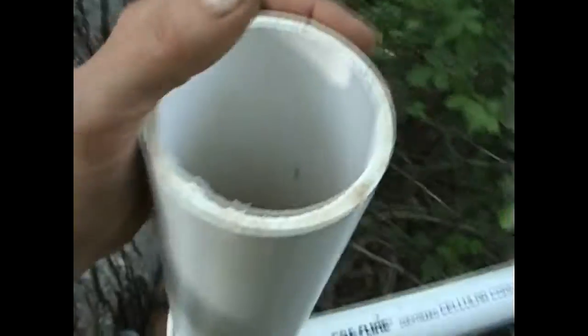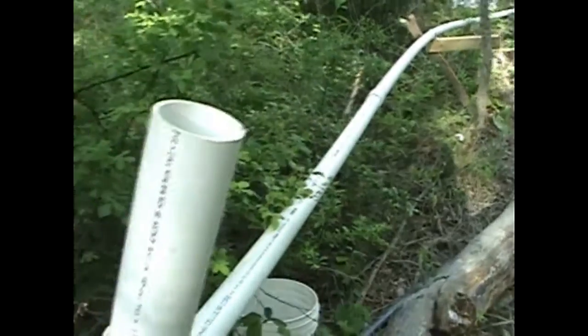Trying to show you water — last time it was really hard to see on the camera. There we go — now you can see it pulsing up and down. Anyway, it comes through the standpipe which basically dissipates the shock wave so it doesn't travel up the rest of the two inch pipe and break the pipe apart over time, or prevent the pump from functioning due to interfering shock waves.